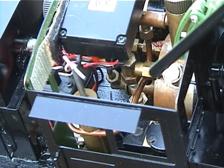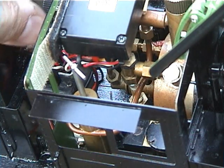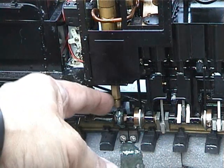Once the boiler is fully depressurized, we can refill the boiler with water if necessary. As it happened, I had pumped some water in just before the fuel ran out this time. We've got 3/4 of a glass, so that's plenty. Close the throttle at that point. Close the blowdown valve by gently turning it in the forward direction.